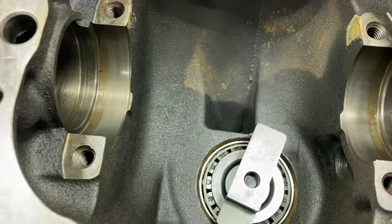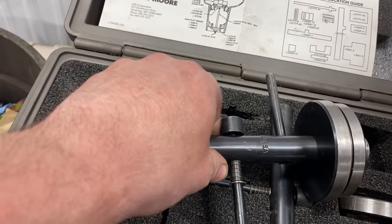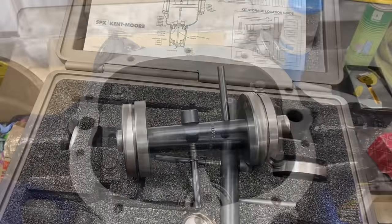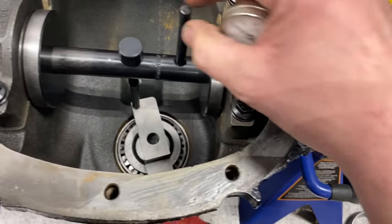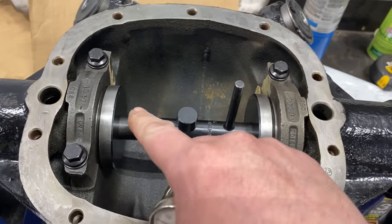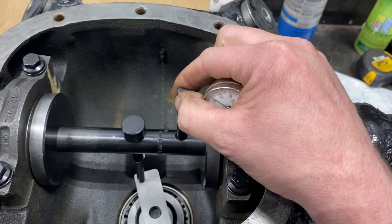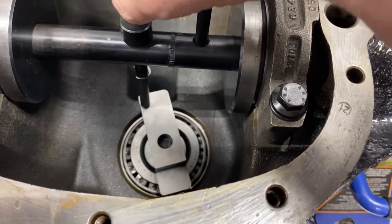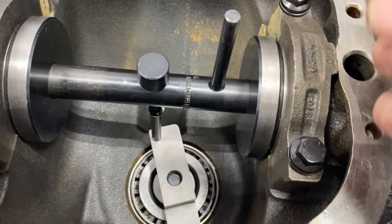When we come back from a commercial break, I'll put the carrier block in here with the spring-loaded deal, and I'll have the dial indicator set up. We've got the arbor and the gauge plate and everything mounted. I've got these bearing caps torqued to 60 foot-pounds. I've got to make sure our arbor moves freely. Basically how this works is you see this little plunger here is spring-loaded.